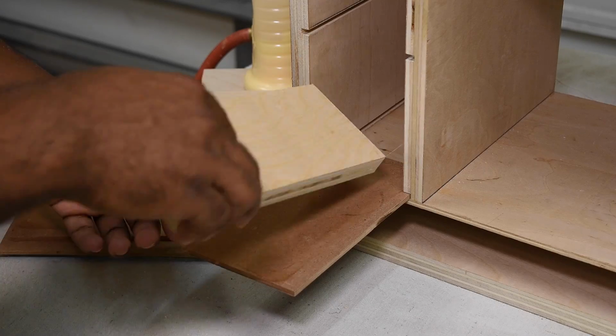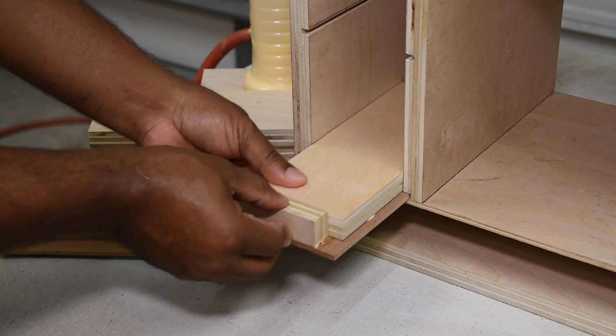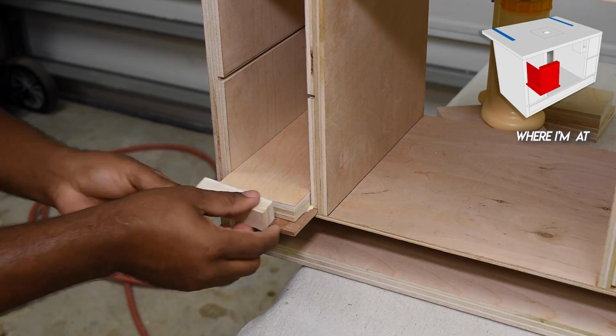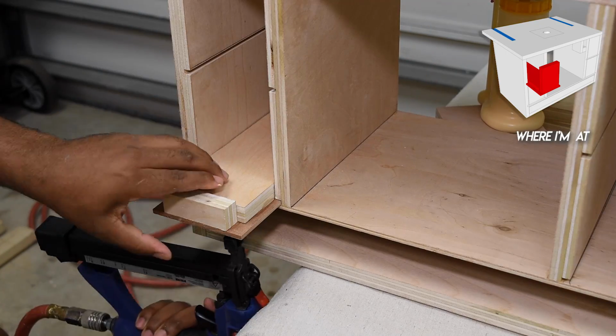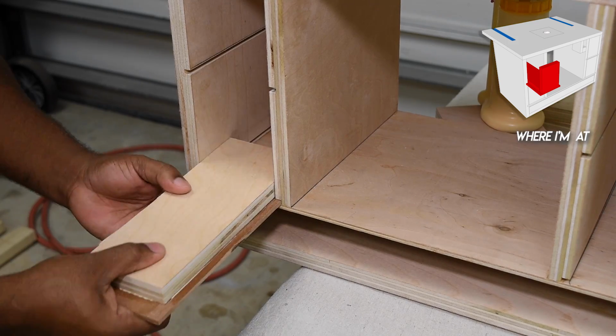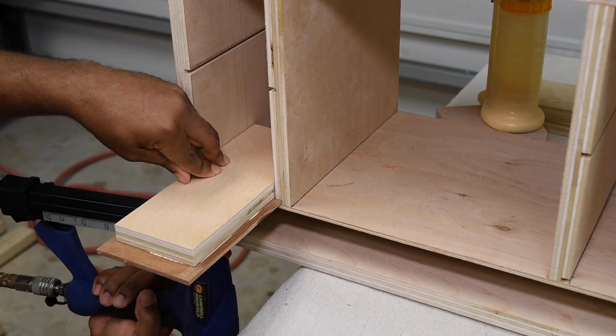The small drawers are really simple and it's only made up of 3 parts. The bottom, which is made up of some hardboard that I had left over, a piece of plywood to give me the depth for the router bit, and also a front. The important thing here is to not get wood glue in the tracks because this friction slide will not work.